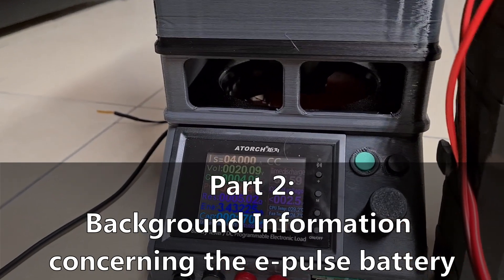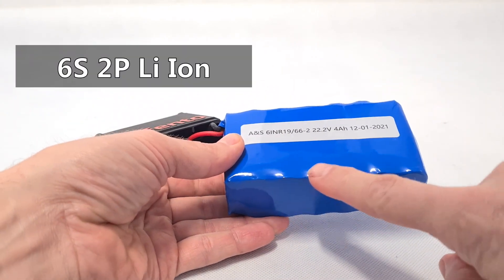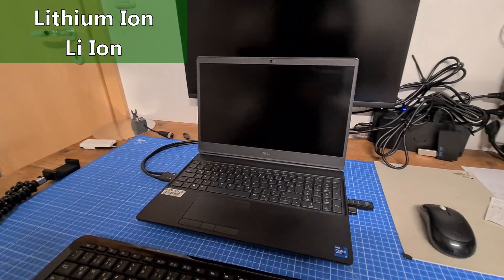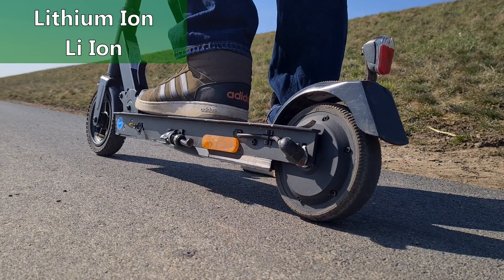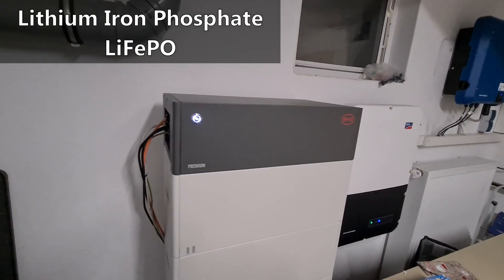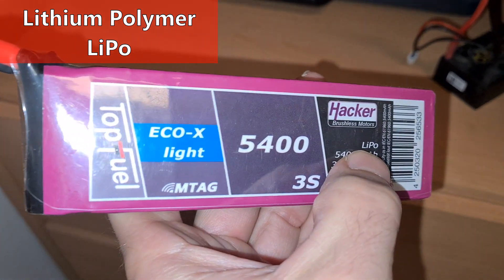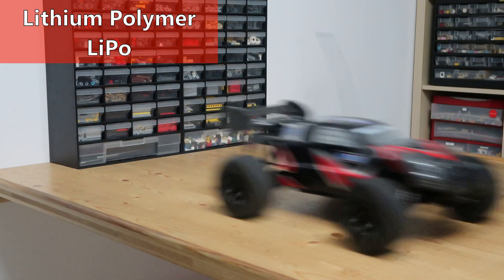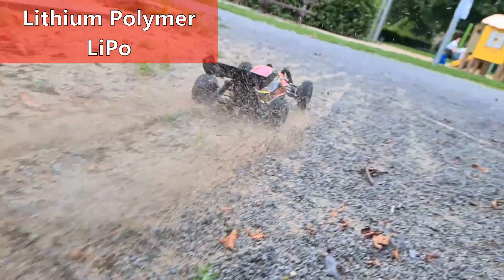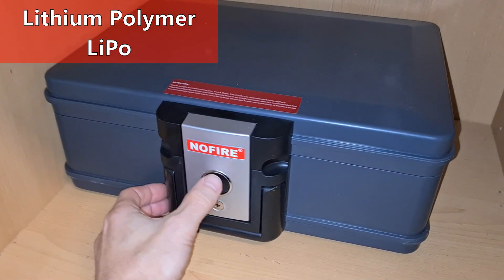Part 2 — some background information concerning the ePulse battery. The ePulse battery is also called a 6S2P lithium battery. Lithium-ion is the galvanic type — a very common battery type found in laptops, home appliances, and electric vehicles. Don't mix them up with the rock-solid but heavy lithium-iron-phosphate batteries used for solar energy storage at home. You may have also heard of lithium polymer or LiPo batteries, which have an unbeatable power-to-weight ratio and are used in high-performance toys like RC cars, planes, drones, and helicopters. Unfortunately, they require precaution or they can explode — they should only be stored in a discharged state and in a fire-tight safe.